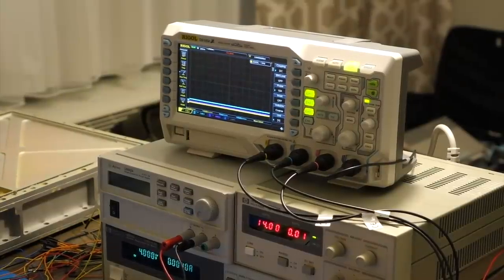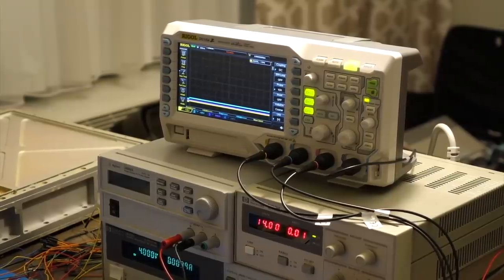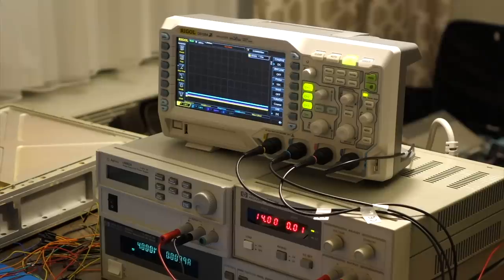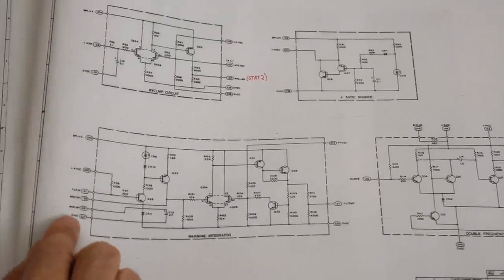Yep, so the yellow line here is either the CMC or the LGC light in the command module or lunar module control panels. So that's a bad light. I've never seen it implemented like this. A watchdog that lets a few come through, but if it becomes too insistent, it goes nope. I wonder how they came up with this thing. And that's how the clever guys implemented it.